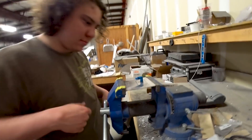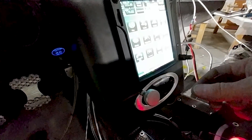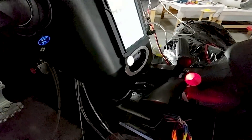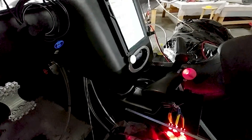That'll allow us to pull brake fluid up from the calipers all the way through to the reservoir. Back in the cabin, I've been working on the hand brake knob lever — it's pretty basic: you push it in and it clicks into place, stopping it from accidentally pulling out from vibration while flying. That way there's no chance of landing with the brakes engaged. You can actually see the lever being actuated in the middle of the screen — that's where the valve is on top of the keel.